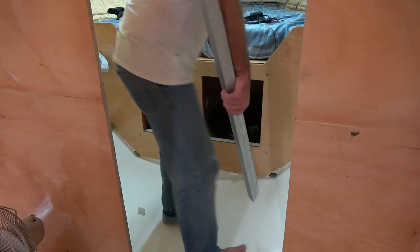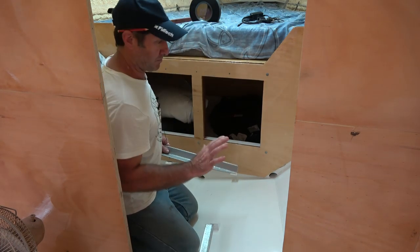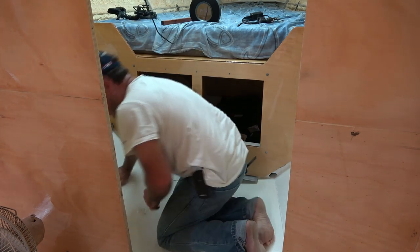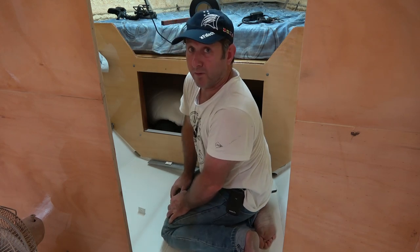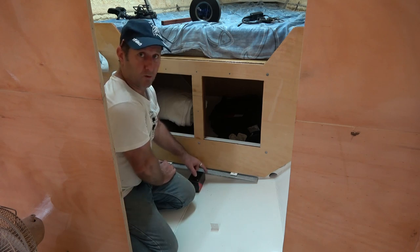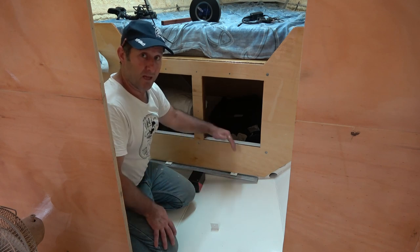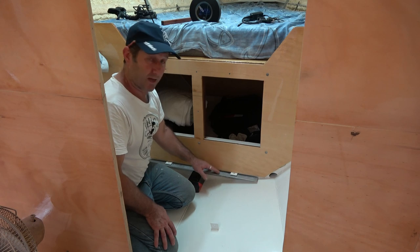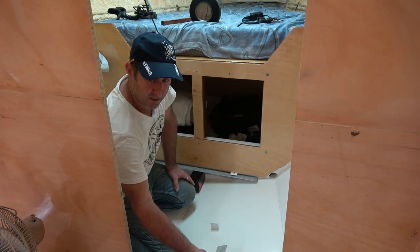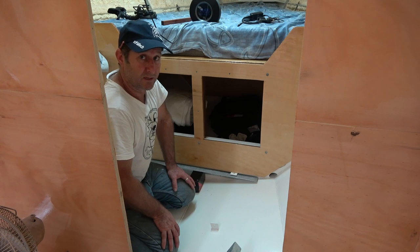Okay so let's see how these worked out - just telling myself don't bang them on painted surfaces. Oh, that's a treat - well off that end too, good one. Just to explain also, I've opted for hot dip galvanized angle because that way, obviously where I've cut the ends that will need to be painted, but otherwise I can just leave that as is. Hot dip galv - it's had a very good dosing, I can tell. Paint the ends twice, bolted in place, and that's done. I'm very pleased with that.